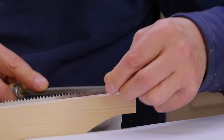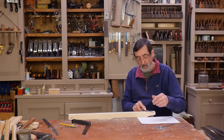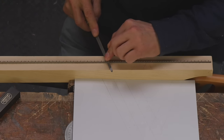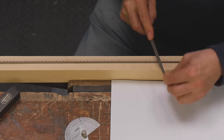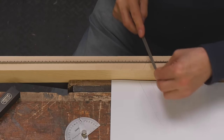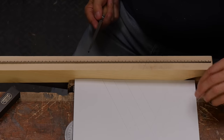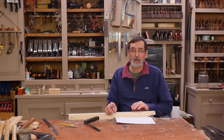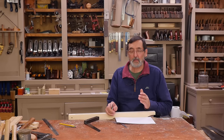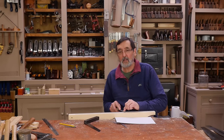The file is level across from my hand to my second hand, but when you look from the top looking down you'll see I'm trying to follow the original pattern. Don't get hung up on that angle — the edge is going to be sharp and the pinnacle tooth is going to be sharp. If you find yourself drifting and losing concentration on the angle, it's not going to affect the saw too much. Just have something to aim for. Focus on getting the file deep into the gullet and following the present angle of the saw all the way through.